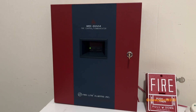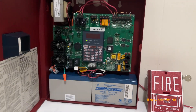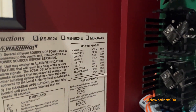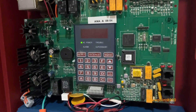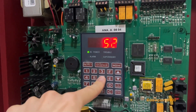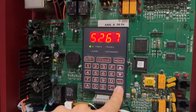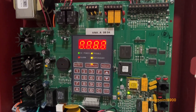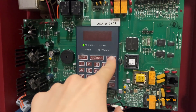The keypad on the 5024 has the same functions as the 5012. At least on this panel, it lists all the available functions right on the front. So real quick, let's do a lamp test — press mode and enter the code, and you get lamp test. You can also do a drill.